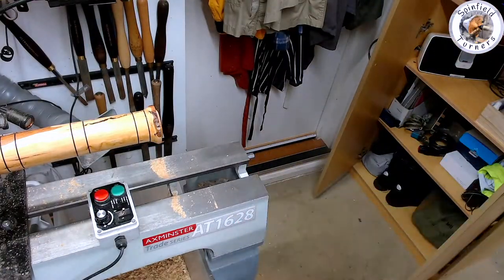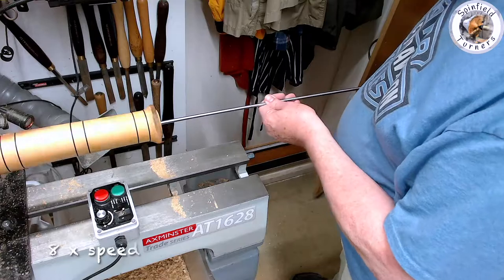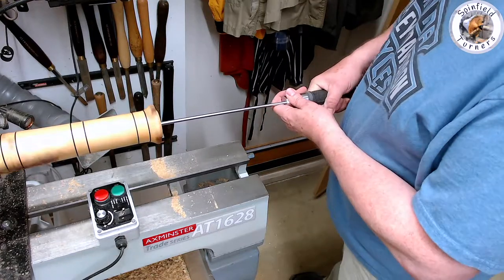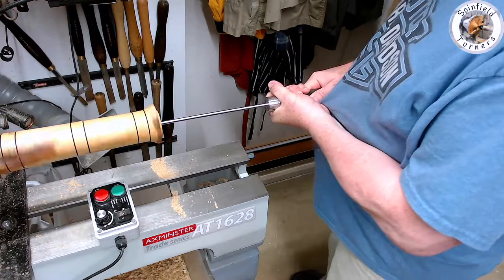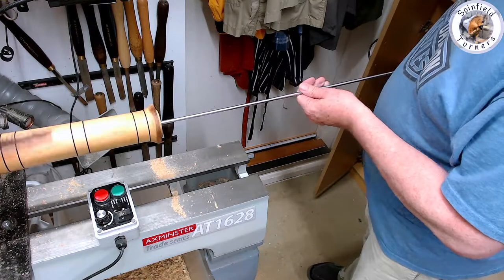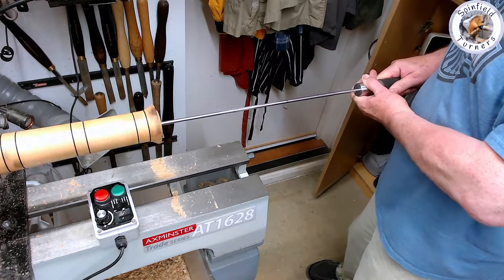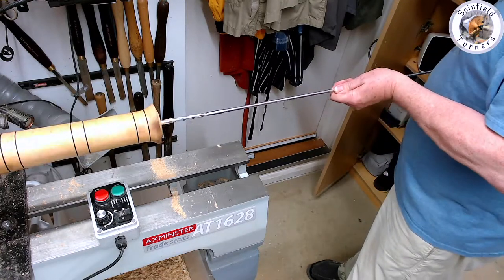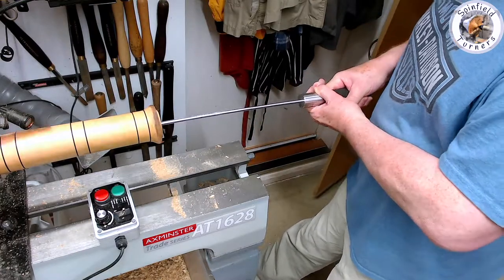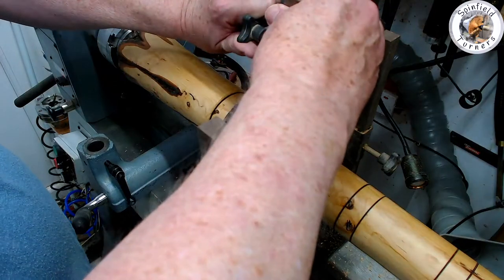I got to the end of the length of the drill bit. At this point I should probably have reversed it and drilled from the other end, but I wasn't completely sure whether it would wander and we wouldn't meet in the middle. So I've removed the tailstock and I'm going down by hand hoping I'm keeping it straight — but as you can see I'm actually bending that shaft, so my suspicion, confirmed when I finished, is that this will be slightly knocked off center. Not a problem, but something you have to allow for. Finally through to the far end — whatever you do, don't get it jammed. I can now remove the steady rest.